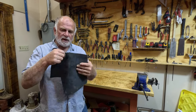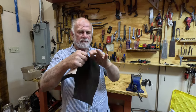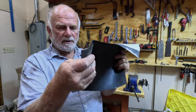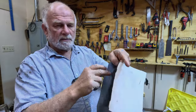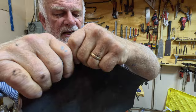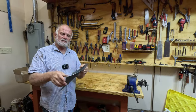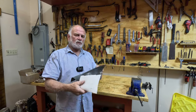Here's a sample I made of a super silicon seal on an EPDM roof. I want to show you how unbelievable this super silicon is and how it adheres to the EPDM. This is EPDM rubber, like in a car tire. I painted it two colors — white and black — with super silicon. Look how it stretches with the material. It sticks to EPDM and adheres so well. This is an amazing product. That's why you can paint it over a clean EPDM roof, over the seams, put your tape over it, and it will never leak.